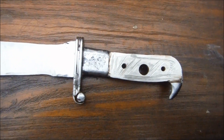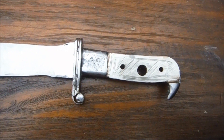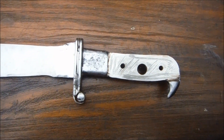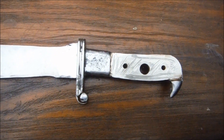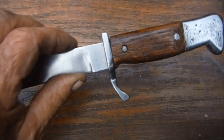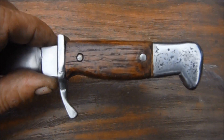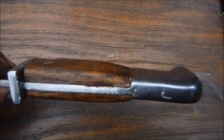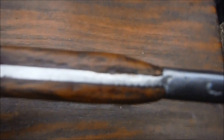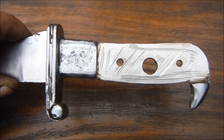There's definitely more cleaning and polishing to be done, but I am reaching a point where I'm starting to think about what sort of material I might use for the side scales. The original German knife had antler, my cheap replica has plastic antler. I was thinking of wood — I have done another German military knife where the original had come with black plastic side scales and I decided to use a nice piece of English oak. When I was making this I did come up against something of a problem: steel is far far heavier than the cheap alloy used in the original knife, which means the pommel had to be rather thinner, lending a rather odd shape to the handle.